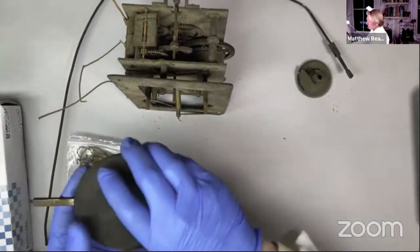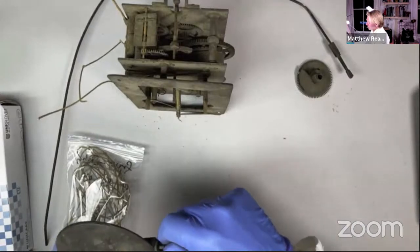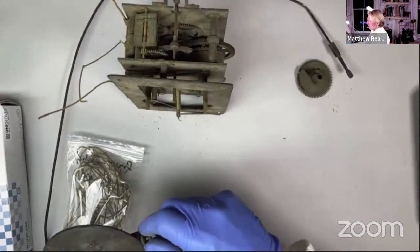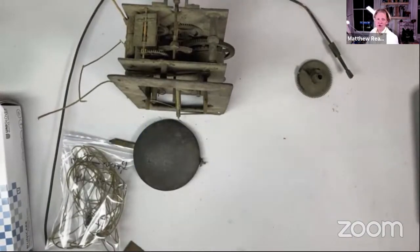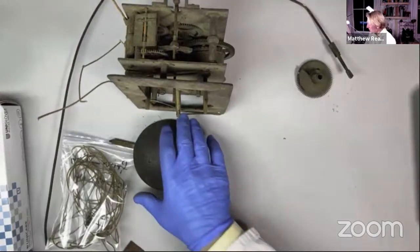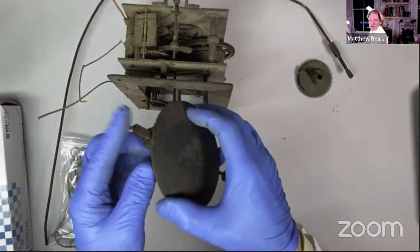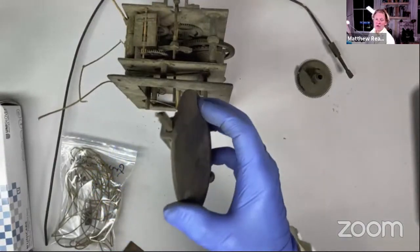Now, in this case, the rating nut is pretty, I don't know, think about that. For sure, a spacing piece there would help massively just to help the client rate it. And you can make that out of some material, make it out of a bit of Delrin or something. So it's obvious that it's later. You could stamp the date on it, so it can be undone at any later date. But of course, what we've got here, we'll have a closer look later, but the rating thread, sorry, the rod where it goes into the bottom block is snapped off.